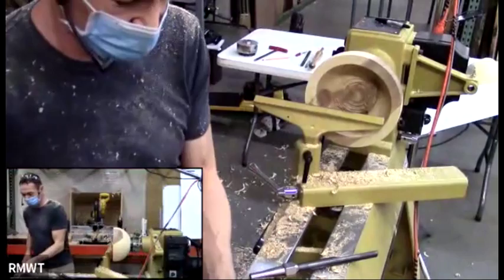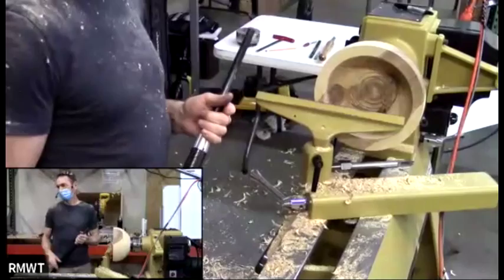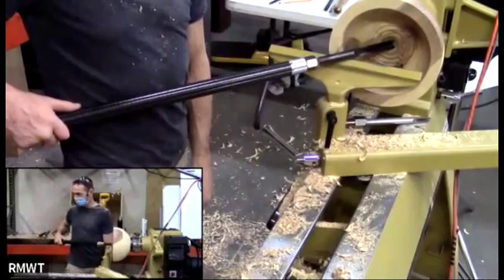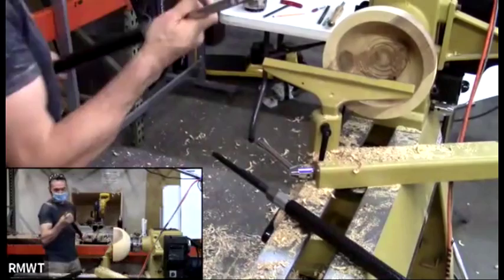The reason they get it wrong is for 2 reasons. One is they're going to block the tool's path, and two, they're going to stand too close to the lathe. So the end of this cut is when I'm back from the lathe with my right foot forward. That's going to let me pick up on the cut where it starts from, and get to the middle. And there's a lot more swing from here to here than there was before. The other gouge only swung a tiny amount. When I say a tiny amount, it seems like less.